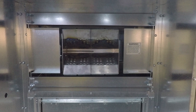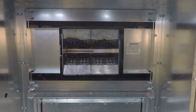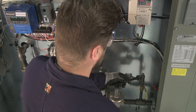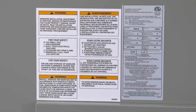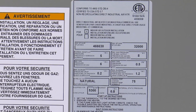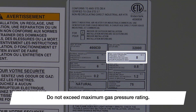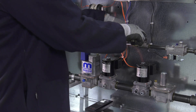To decrease the pressure differential, increase the burner profile opening evenly or decrease airflow. Verify the unit's inlet gas pressure and compare it to the gas information label located on the control center door. The supply gas pressure needs to be equal to or greater than the minimum for maximum output on the label. Connect the gas manometer to the unit's pilot pressure test port.